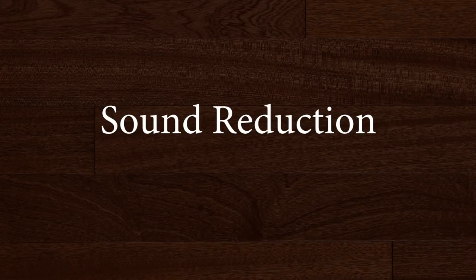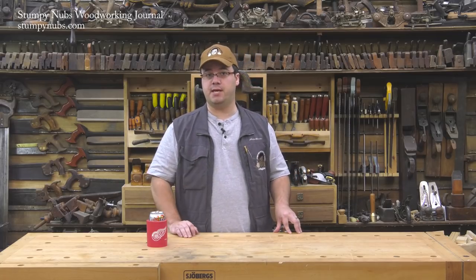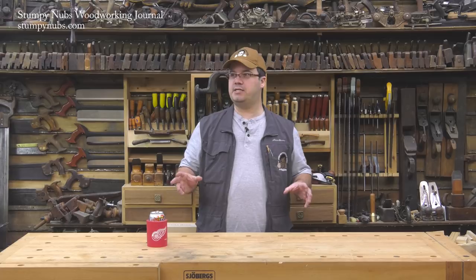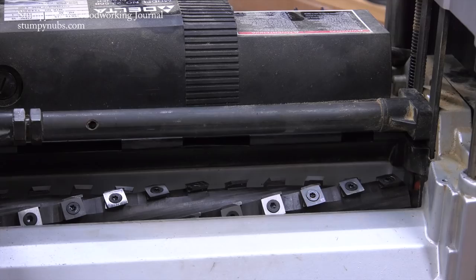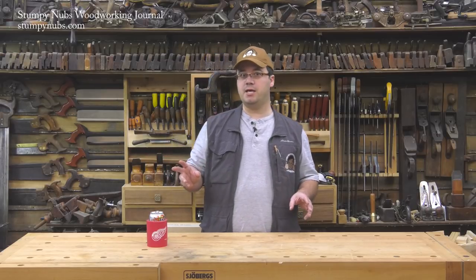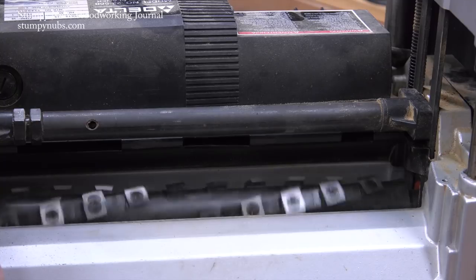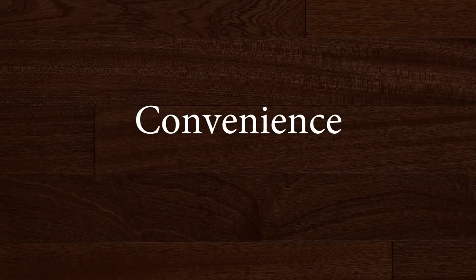In that more comprehensive video I explained why helical cutter heads are quieter — maybe as much as 50%. Now after two years I'm going to say I don't consider that to be a major factor. My jointer is reasonably quiet, but my planer is the most noisy, obnoxious machine in my entire shop. It always has been — it's just the nature of those brush-style motors. Having a helical cutter head has probably lowered it a little bit, but it's still ridiculously loud. So I don't consider noise reduction in itself to be a really good reason to go out and buy these cutter heads.